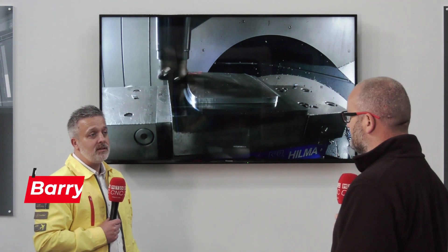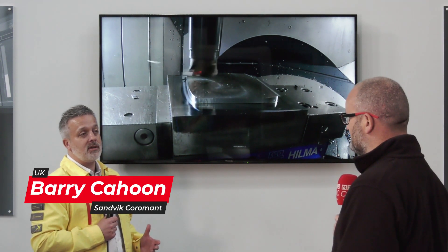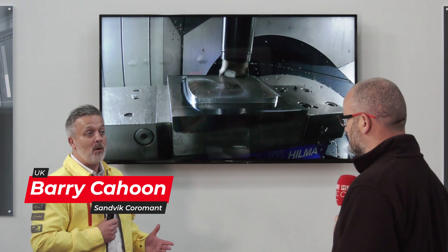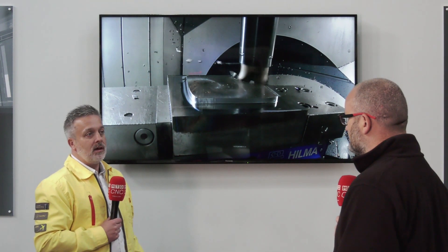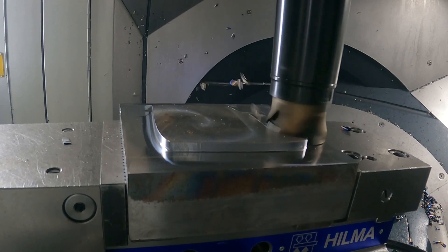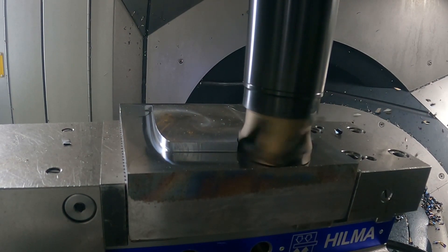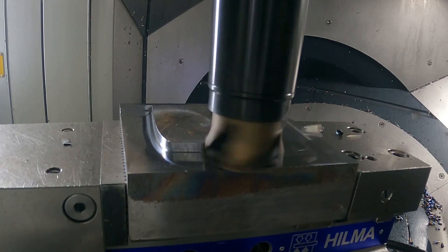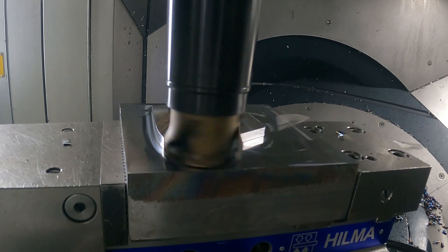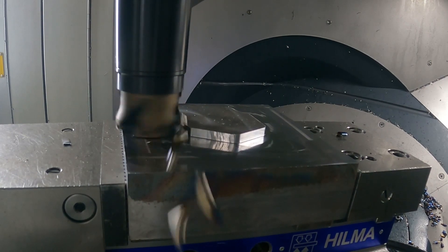This concept here, the 390 Lightweight, is the first additive manufactured cutter on the market that's 90 degree. It's light in comparison to the steel-bodied concepts that are out there — probably about five times as light — which enables us to use this concept when it comes to long overhangs.